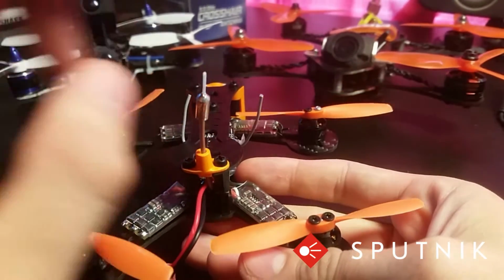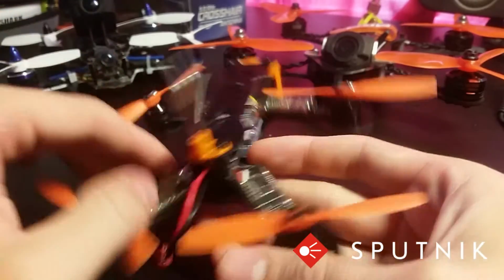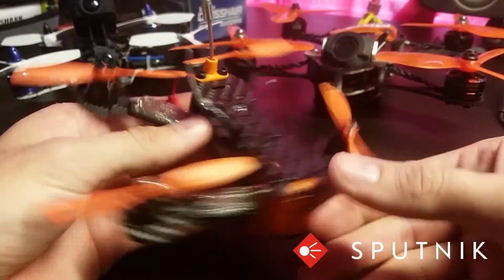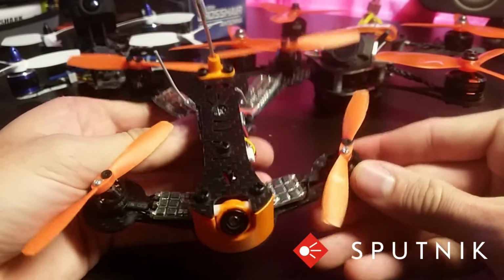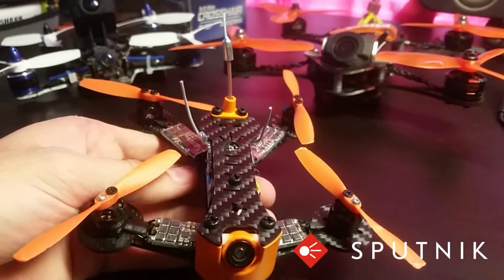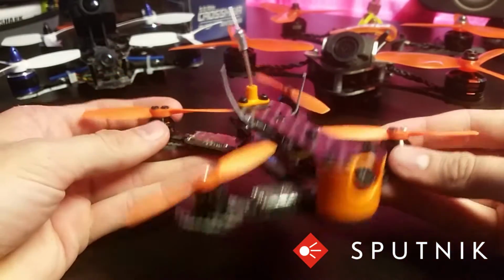And I didn't use a clover, but honestly, I don't get a whole lot of breakup. I'm going to show y'all some DVR footage at the end of this, but it's a LaForge diversity, and the antenna switching will cause a lot of static. So it's actually not as bad as it looks.